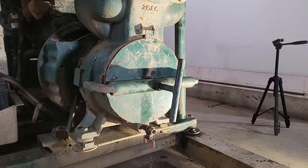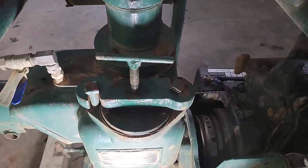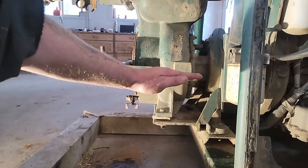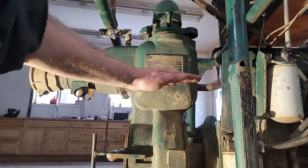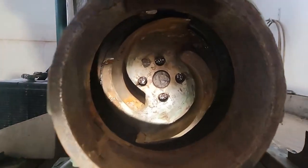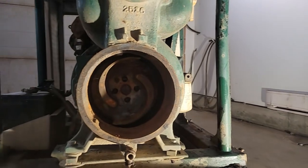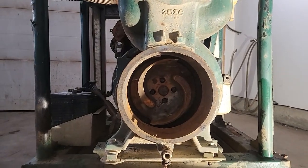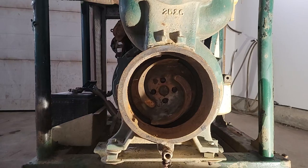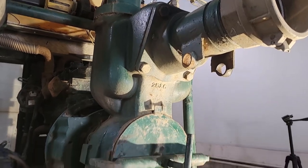So a question you may have is: how does a pump work? To prime the pump, the casing must be filled with water. As you fill the casing, the water level goes above the impeller and fills the entire housing. Once you start the engine, the water will start to get sucked up the intake hose. As the impeller spins, it displaces the air in the intake with water. Any air that is trapped in the system exits through the discharge port. Now the trouble with water pumps is any leaks present on the intake side — the pump will just suck air through the seals or the intake flange. Water pumps always give me trouble and seem to be the number one cause of shutdowns on my site.